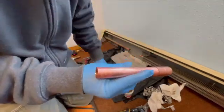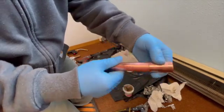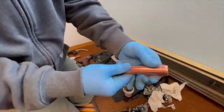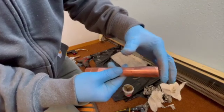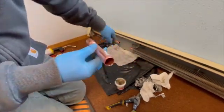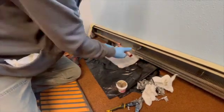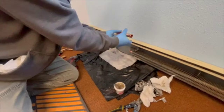I'm going to put the ends onto this copper — one regular coupling and one repair coupling. The repair coupling can slide all the way onto the pipe, and now this is the pipe exposed here. That way I can get this pipe all the way into that spot. I'm not able to push the pipe apart, so I have to fit something into it and then connect it.